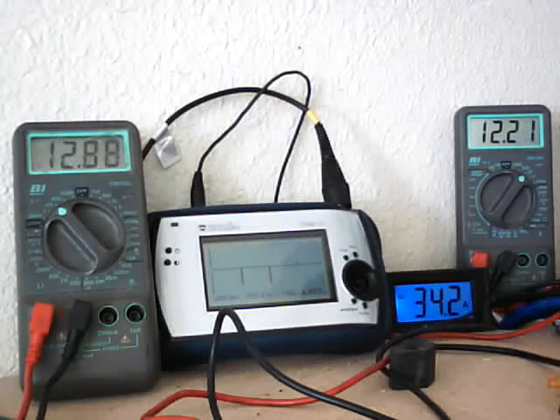I'm going to turn it quite a bit because these are 20-something turn pots on there. Let's get it going. It should start going down here in just a second and you'll start seeing the duty cycle show up there. We're going to set this thing down to about 30 amps — we'll get it to stop right at 30.